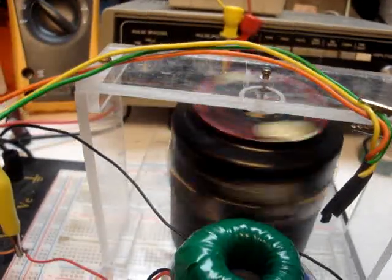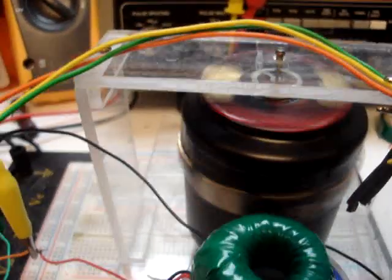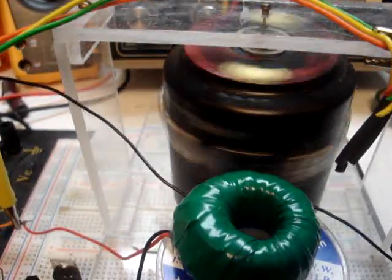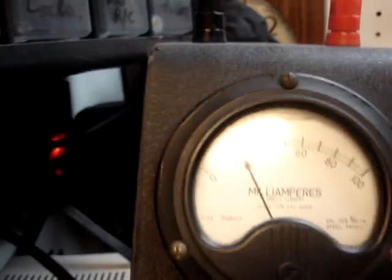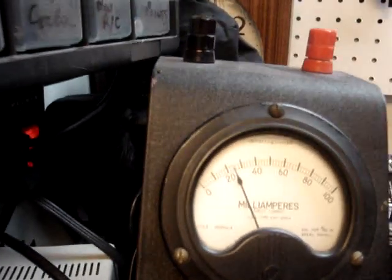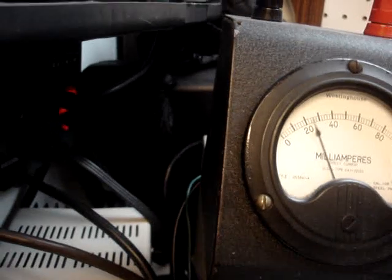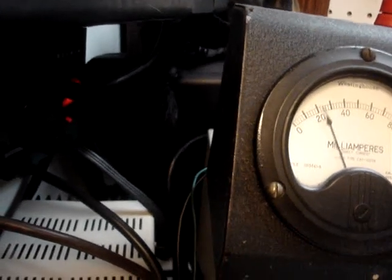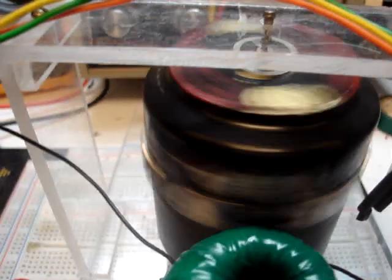It's running — it's highly unoptimized. I was mainly just testing out a toroid coil I had to see how effective it was, and I discovered it would run down on extremely low voltages. There's the pulsing current that you can see on a milliamp meter. The coil is 7.4 ohms and it's about 600 mH of inductance as I recall.